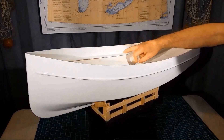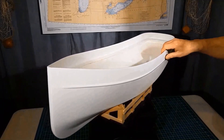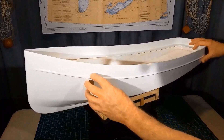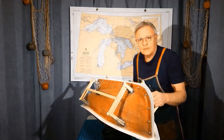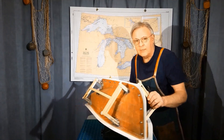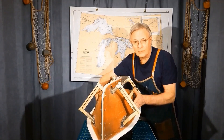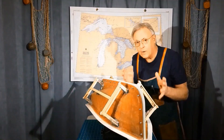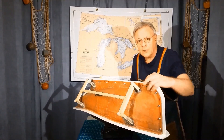At the same height of this flange is the top of the gunnel, which is a big help knowing where you're at inside and outside the boat. This bulwark can be cut, trimmed, modified in any way, or completely removed. The Haven 34 design has a reverse bow and a reverse transom. There's also tumble home on the sides, in the bulwarks, and there is a gunnel. So that hull shape will not come out of a one-part mold — it has to be two parts. Here is the right and the left, bolted onto the plug.